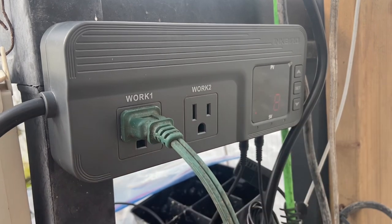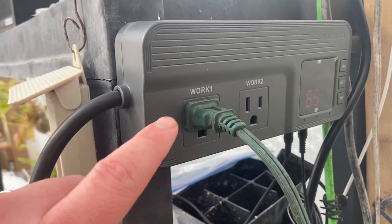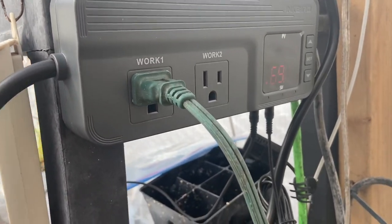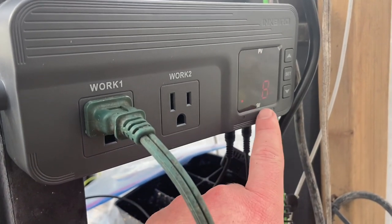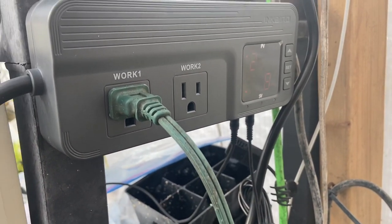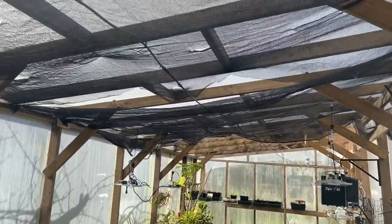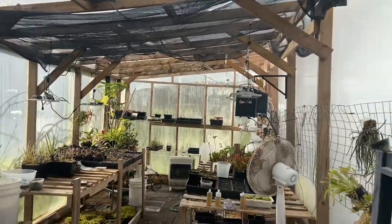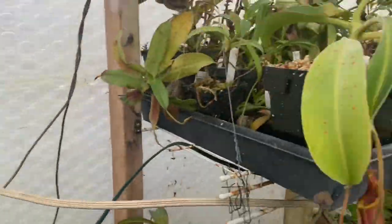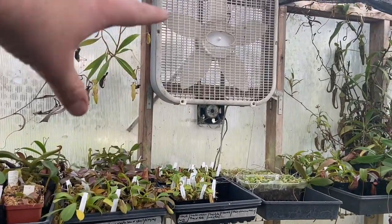Being it's so warm in the greenhouse, I want to keep it under about 28°C if I can — it's a highland greenhouse so I don't want it super hot. I have it on cooling mode right now; humidity is set to about 75 and it's currently at 69.8 because I unplugged it. The sun just came out and it's really getting warm, so shade cloth definitely needs to be on. I turned the fans off for the video.